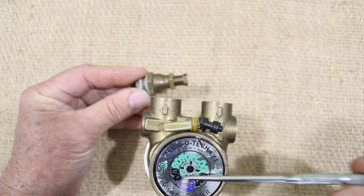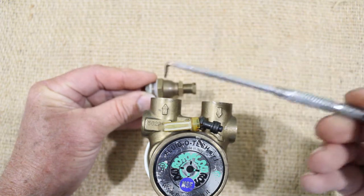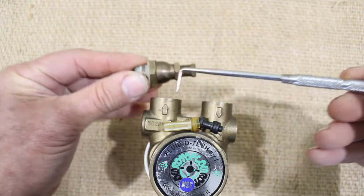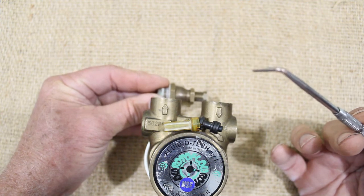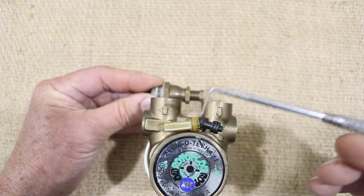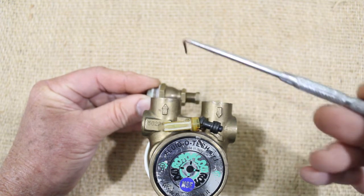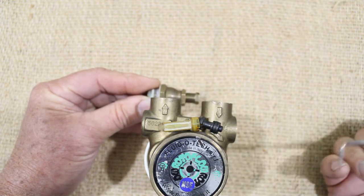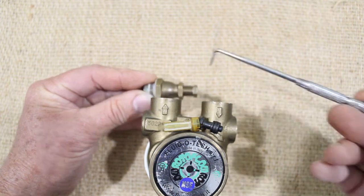As water is forced by this positive displacement pump into the water galleries circuit, if there is a restriction there and not all of the water can pass through, pressure will start to increase. The same as putting your thumb over the end of the garden hose. If you try and clamp the thumb over the hose fully, pressure is created and it blows the thumb off the end of the hose. In this scenario, if we restrict the flow out of the pump and pressure builds, it tries to find the weakest point within the entire circuit, and that has been engineered in here with the pressure limiter.